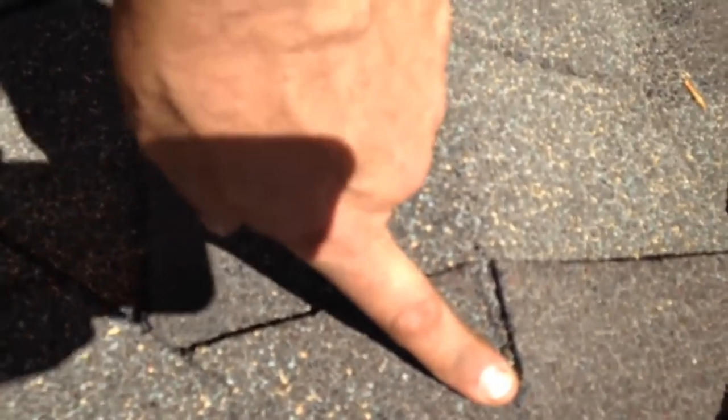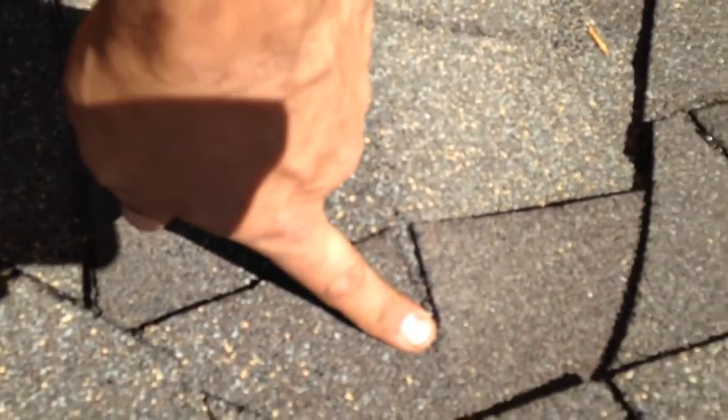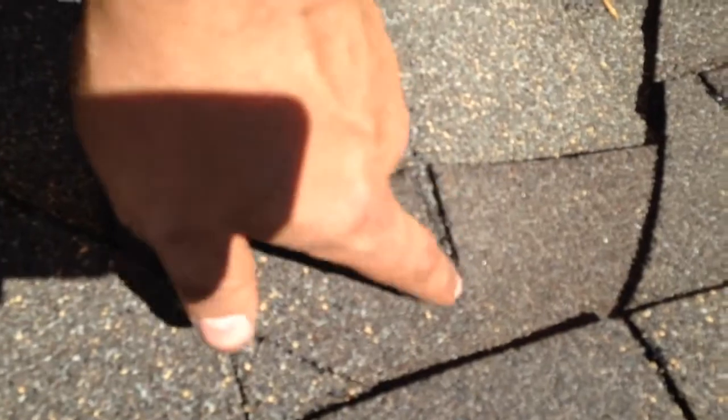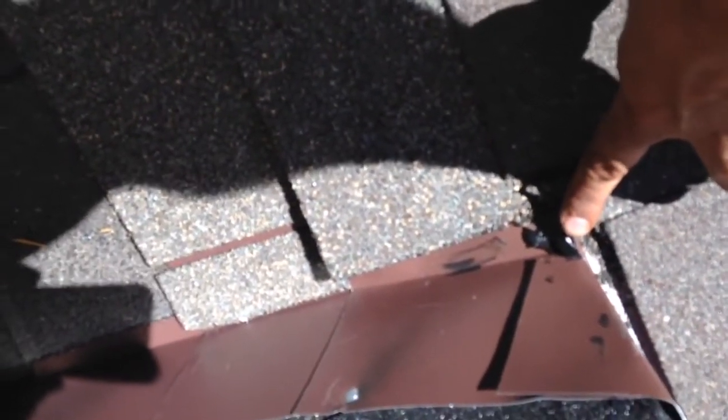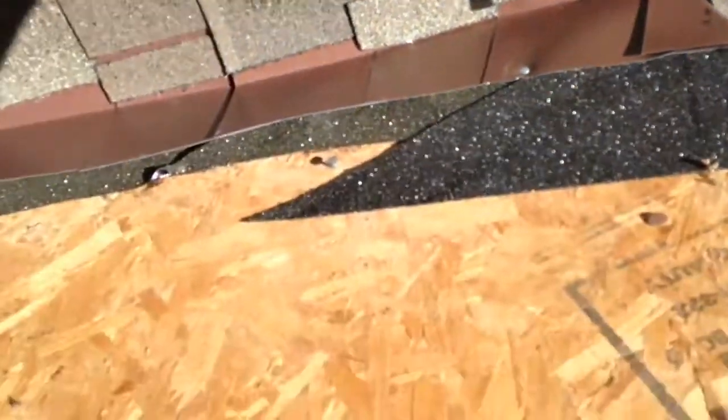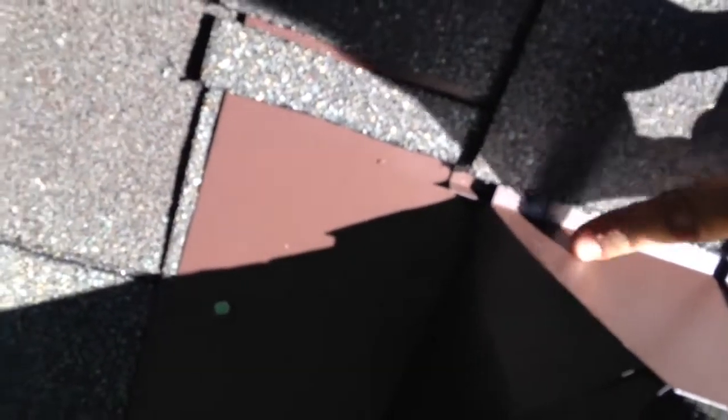Beneath here there's also about a little more than a quarter-sized sealer applied. There's no hole here, but the sealer is up. Anyway, that's done right. Then on this side, same thing — same corner detail, same diverter, same dog-ear, everything shingled all down the sides. Back to the other side where our shingles and flashing are installed — same NRCA detail right here. So that's the flashing complete.